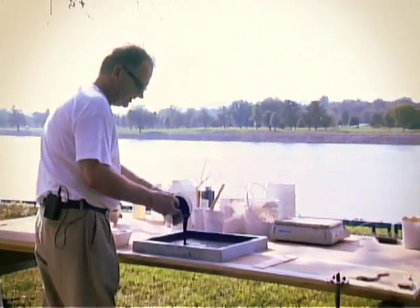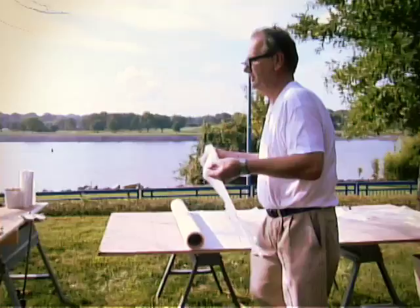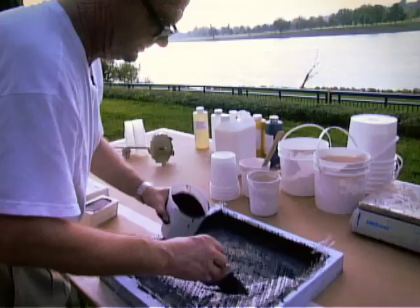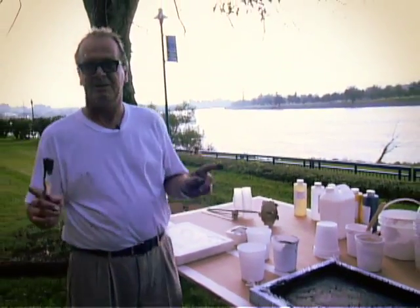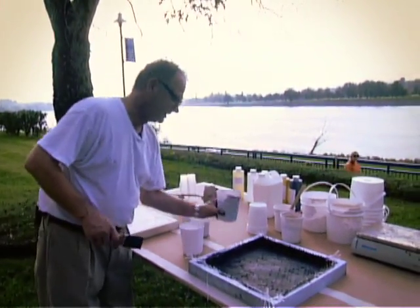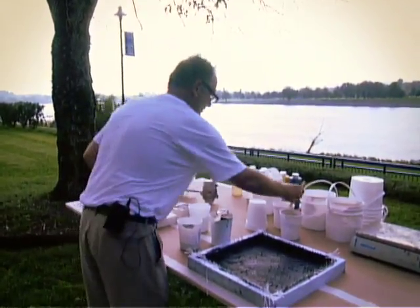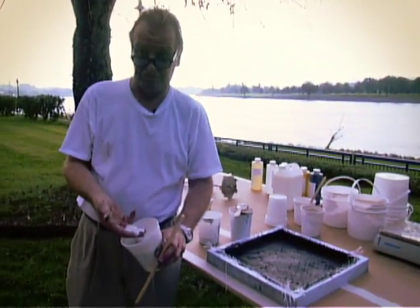Pour a little on the back of the gel. Make an even coating. Now pick up the first layer of the fabric, place it onto the tool. Work it into position with a brush, just enough material to wet it through. Now, you only need two layers; however, it is important that these two layers are spaced apart. One of the easiest ways to make a spacer layer is to take the majority of the remaining material, put it into another pot, and add some chopped fiberglass strand.